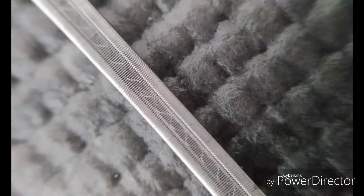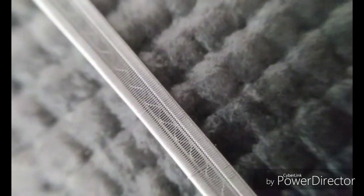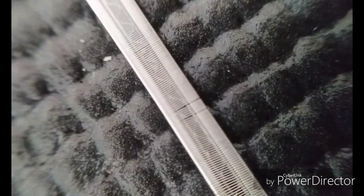So it's 8-ply on each side. And then 5-ply in the middle. One's corrugated. All the ribbon on the inside is stainless, but the rails, the frames, are equally mixed Kanthal and Nichrome. And all 40 gauge Clapton. I think I should be able to wrap this up, hiding any kind of mistakes.